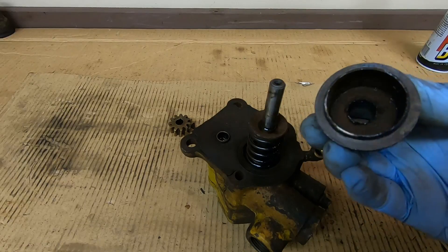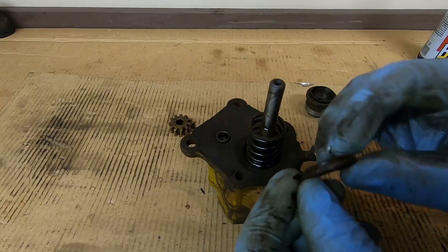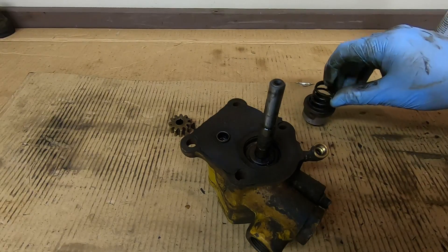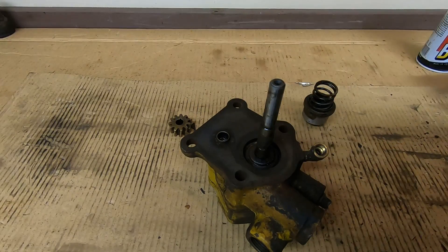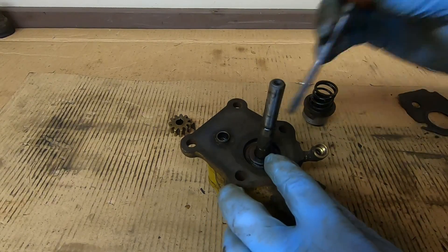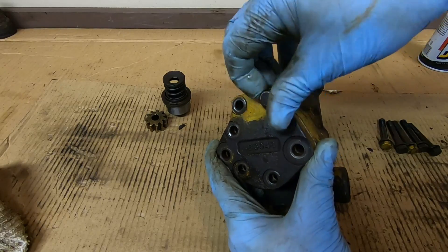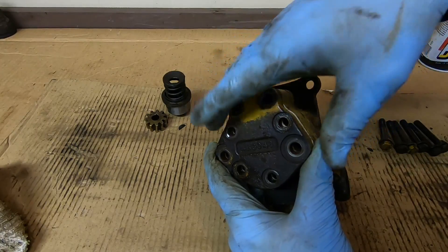There's the one packing seal in there — it's kind of a cone-shaped thing. Here's a washer of corresponding shape, a little bit rusty. That provides support for that seal, and there's that spring. Looks pretty good actually. The paper gasket can come off that cone-shaped piece — it kind of sandwiches that on there. There's the other washer and the other packing seal. Working on the front side now, I'm going to take the pump body apart to have a look at the plates and the gears — this is really going to tell us the story.